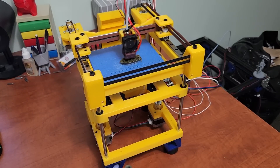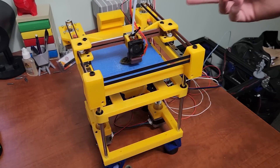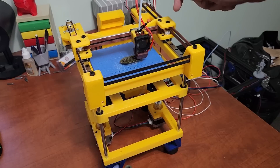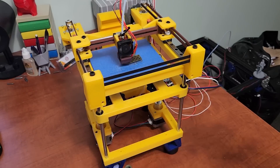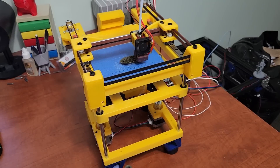This printer is CoreXY. I wanted to start using CoreXY a lot more, so I wanted to design a CoreXY system that's compact. These are MGN9C rails — very small rails — and I wanted to fit all the CoreXY components on them, because I want to use these CoreXY parts for other printers as well.